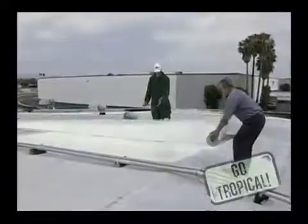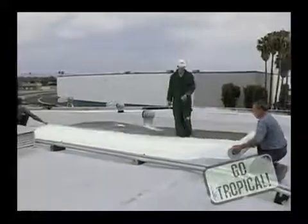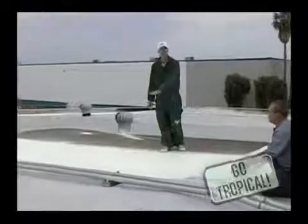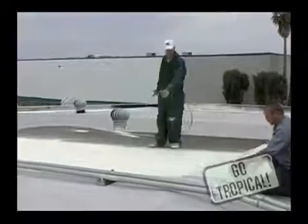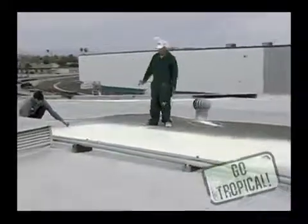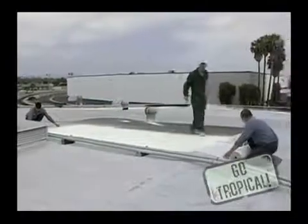As you can see, we've got our base coat set into place — about a gallon and a half per square down. We've drawn out our polyester matting. We're using a soft polyester today; we're going to lay it down smooth and easy. We want to ensure that there's no buckling, no wrinkles — we want a flat surface.